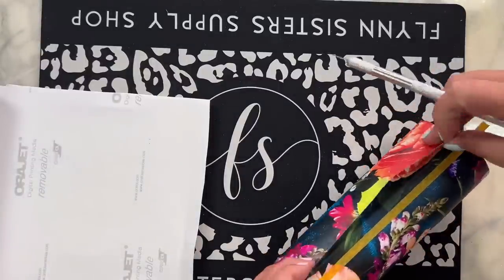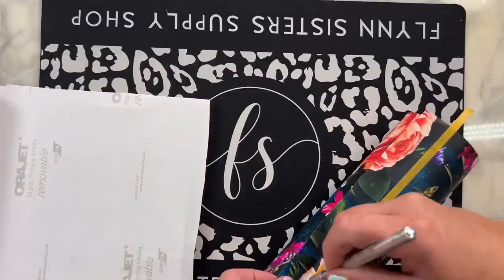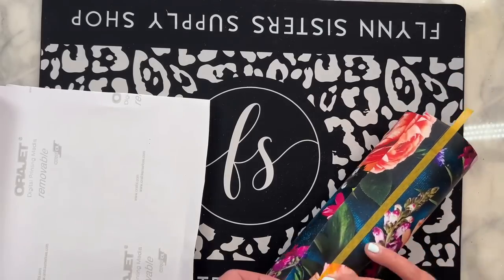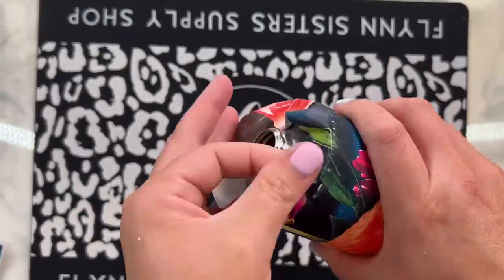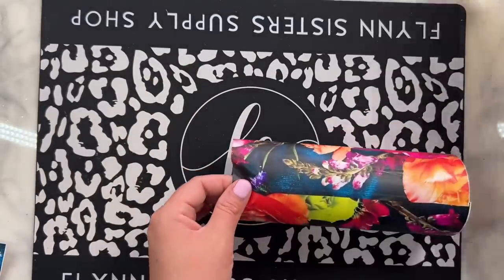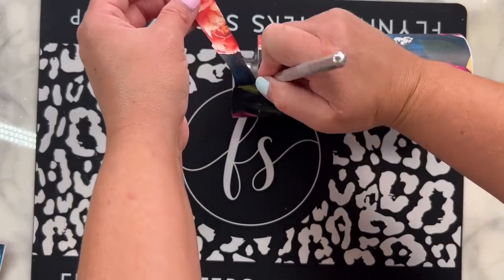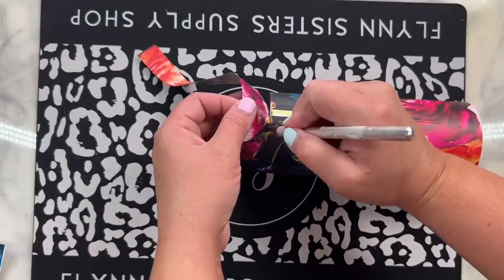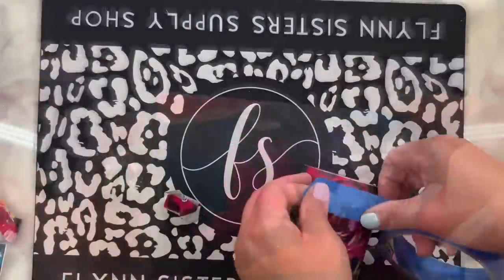When we get to the end, I'm going to see where that seam is and place a piece of tape to guide my craft knife while I trim the excess. Next, I'll pull the excess vinyl at the top nice and tight and run my craft knife right along the corner at a little bit of an angle. You definitely want to make sure you have a sharp blade for this. I'll repeat that process along the bottom before moving on to the next step.